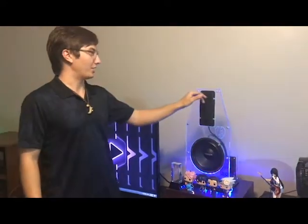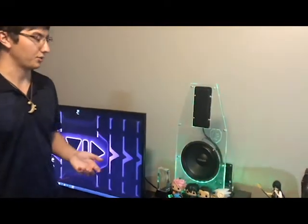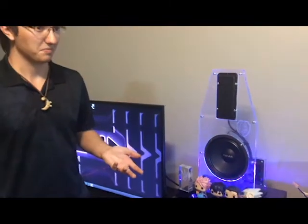All the acrylic glass was laser-cut. All I had to do was measure it out in Illustrator and draw the form that I wanted, draw where I wanted all the screwing points to be, and I only had to make two different panels. The middle panel does have my crest on it that was laser-cut and laser-etched into it, so technically I have three individual panels. It was as simple as getting a quarter-inch thick acrylic glass, doing a rough cut so it'll fit into the laser-cutter, then loading the Illustrator document and just letting it go to town on the panels.